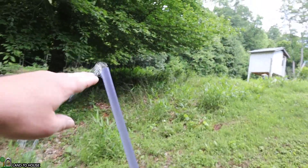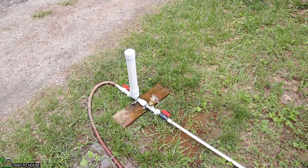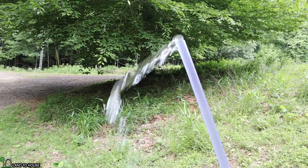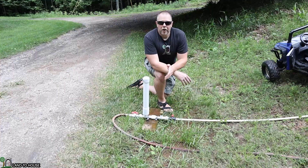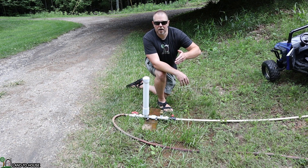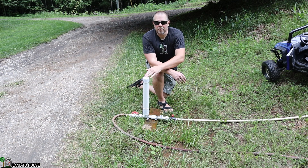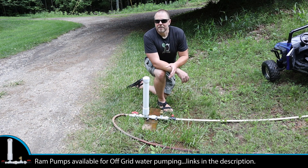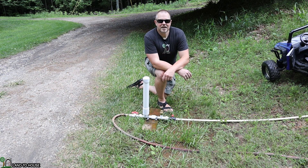What you would want this to do right here is to be up above the source by a foot or so, and this right here would run as long as there's water going into the system. I hope you found this bit of information on stand pipes to be helpful. To recap, just make sure that your stand pipe is close enough to the pump that you have enough drop or head pressure to feed that stand pipe. Otherwise, the pump is going to pull that water down and air will get sucked in and the system will stop. Keep in mind, I have four different sizes of ram pump available on my website — link in the description down below. Thanks for watching. I'm Seth with Land to House and I will see you in the next video.